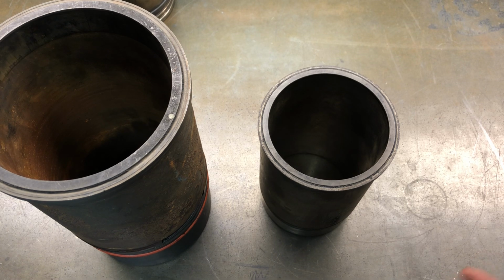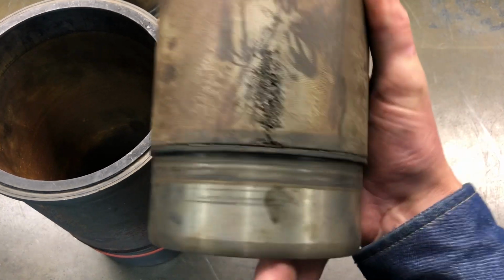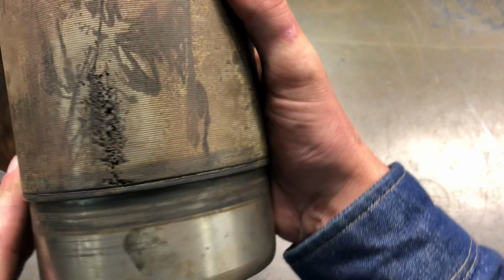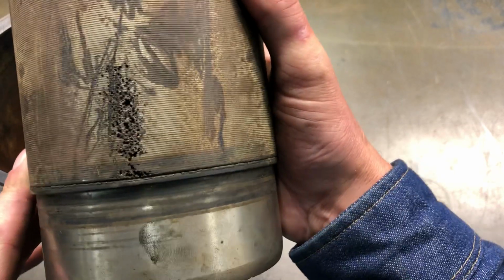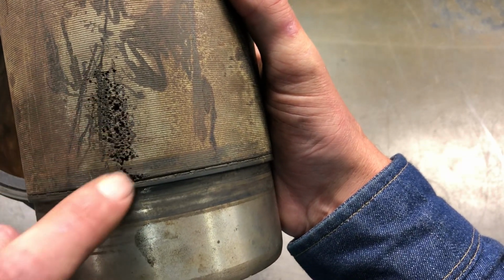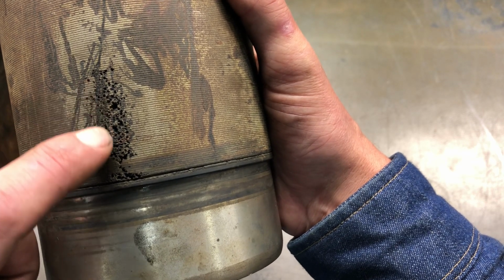You can have higher horsepower because you can make more power since you can get rid of that heat. And they last a lot longer because, again, you're getting rid of that heat. The downsides is they're a little more prone to cavitation. Cavitation would be when you have coolant sitting up against this and this liner shakes a little bit each time that cylinder changes and each time it fires, to where those air bubbles trapped within the coolant are actually imploding and wearing away this metal here.